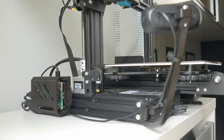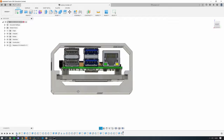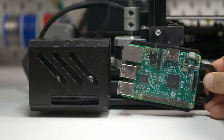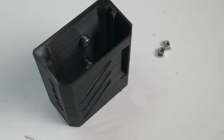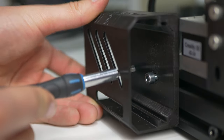I think my setup might be quite interesting to some of you because it's a little bit different from the standard OctoPrint setup. I decided to add a few more things and design my own holders for the components just to make it easier to use in the future and also just to make it look cool. Having nice holders for everything is a must for me, so I also designed one for the Raspberry Pi. A friend of mine recommended me to create a drawer-like design for the Raspberry Pi to easily put it in place and take it out if you need to, and that's what I created. This drawer is also compatible with my robot because I wanted to swap the Raspberry Pi between the printer and the robot. You can just easily attach the holder to the frame of the Ender with T-nuts, and it should be easy to attach to any other printer because a lot of them use aluminum profiles.